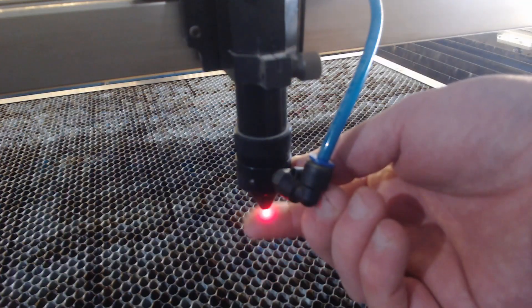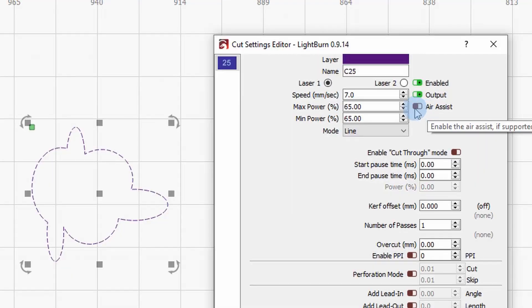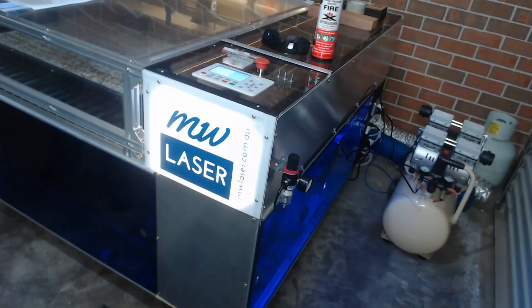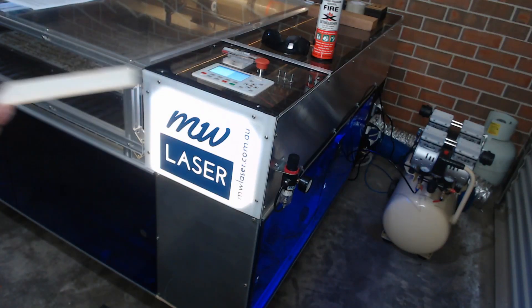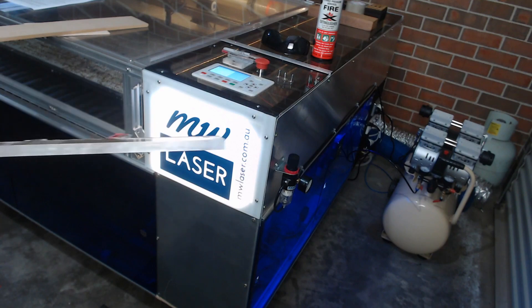Adjust that tap until there's just enough air coming out — just enough to protect the lens, you don't need a fast flow at all. When you have air set on for a cut in your software, this tap is bypassed and the air pressure dialed on the regulator is what will be supplied to the nozzle. So now we have it all set up — what air pressure is required? That depends on what you're cutting. I've tested with various materials and the results vary. For these tests I'm going to show examples using some three millimetre plywood, some six millimetre MDF board, as well as some ten millimetre clear acrylic.